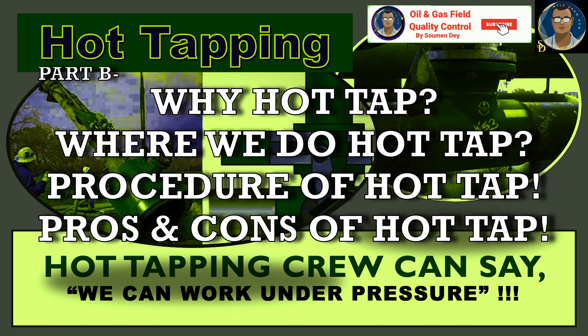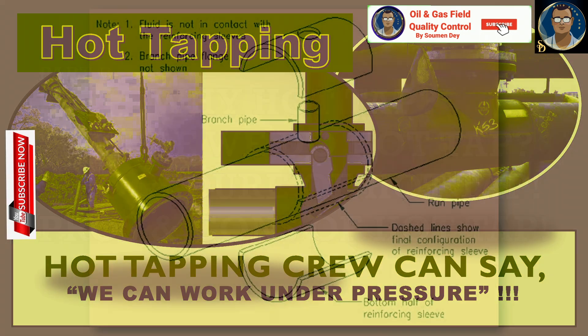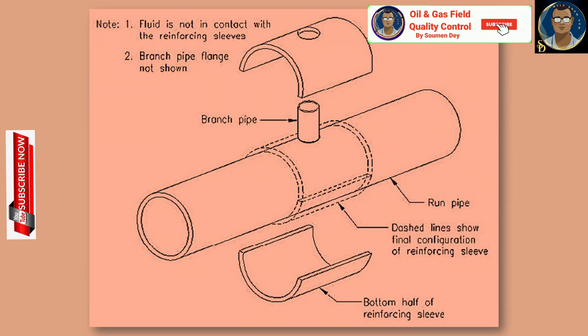There are both pros and cons for hot tapping a pipeline, and it is important to consider both sides before choosing this method for your piping system. In general, hot taps are done in a piping system, but can also be done on pressure vessels and storage tanks to add nozzles. Hot tapping is a highly dangerous operation and must only be used as a last resort when it is impractical to shut down the system. While preparing a hot tapping specification, care needs to be exercised in inspection, design, and testing to ensure a safe and reliable operation.